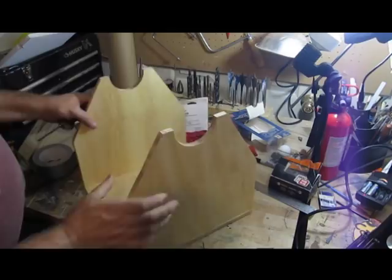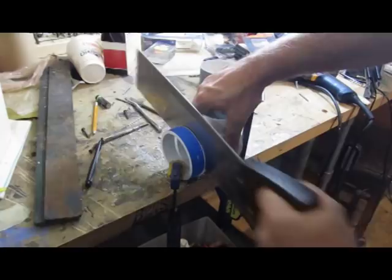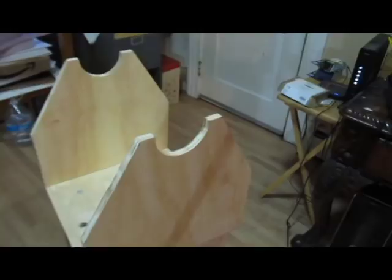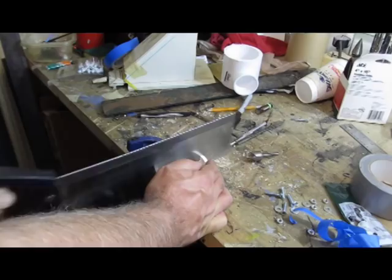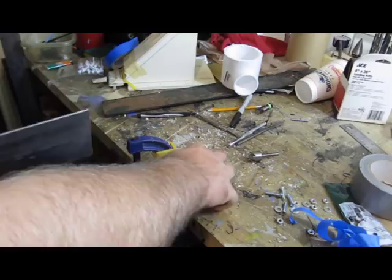There's the yoke. Now this part — you buy one of these, it's called a drum trap, a one-and-a-half by three inch drum trap. Just cut off about an inch — that's the only piece you need. It pairs perfectly with the pieces we mounted on the telescope. We're going to cut it in half and put it in there like that. Notice how the circular hole cut in the wood is a little bit bigger than this — about a sixteenth of an inch bigger. Drill a hole in it and countersink it, just like on the other piece, so the screw sits flat under the surface.